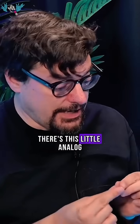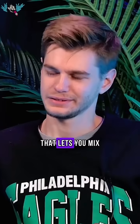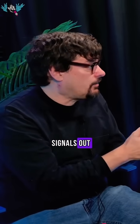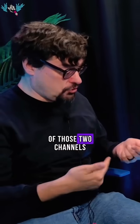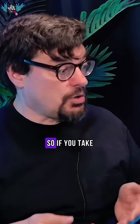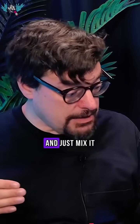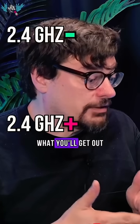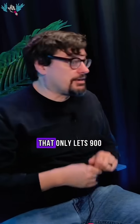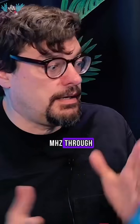How do they get Wi-Fi on 900 megahertz? It is shockingly easy. There's this little analog part called a mixer that lets you mix together two analog signals, and when you mix two analog signals you get two signals out — one which is the frequency of those two added up, and one which is the higher frequency minus the lower frequency. So if you take a 2.4 gigahertz Wi-Fi chip and mix it with a 1.5 gigahertz clock signal, you get out 900 megahertz Wi-Fi and 3.9 gigahertz Wi-Fi. Then you put in a bandpass filter that only lets 900 megahertz through, and you've just turned a 2.4 gigahertz Wi-Fi chip into a 900 megahertz Wi-Fi.